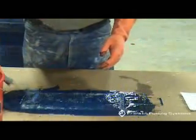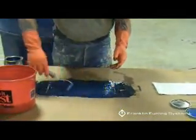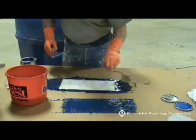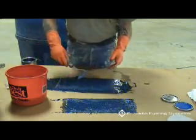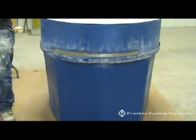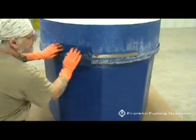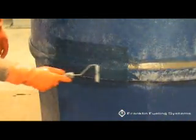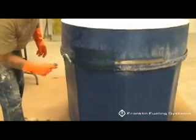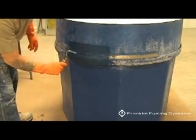Applying resin to mat can be done in several ways. As shown in the video, resin is being poured directly onto the mat material. Another option, not shown, is applying the catalyst resin generously to the puttied sump joint using a disposable paint brush. Paint the resin to the area on the components being fiberglassed, more than large enough for the 24-inch piece of mat to lay on. Apply a fiberglass mat to the wetted area and saturate the layer of mat with the catalyzed resin. First, use your gloved hands to position the mat in place. Then, using a 4 to 6 inch grooved roller, roll over the layer of fiberglass mat and remove any and all air bubbles. Make sure that no air bubbles are present in this layer, as it is the foundation of the next layer.